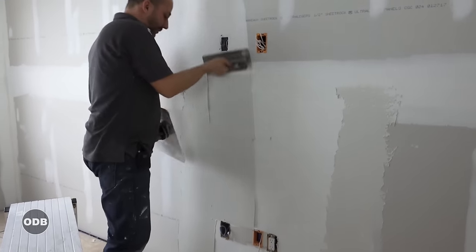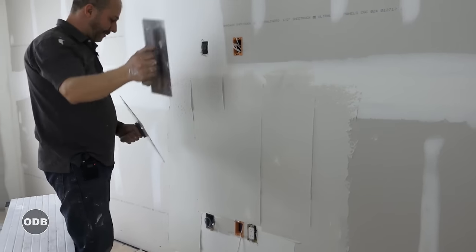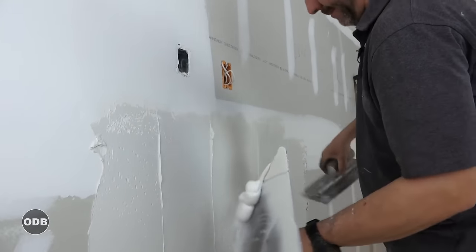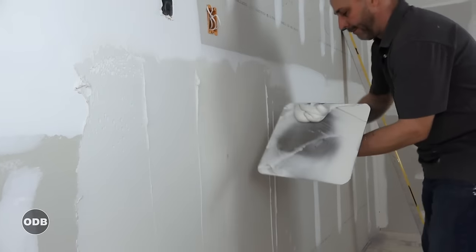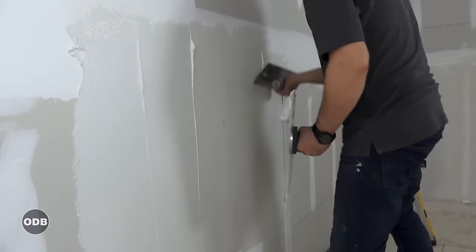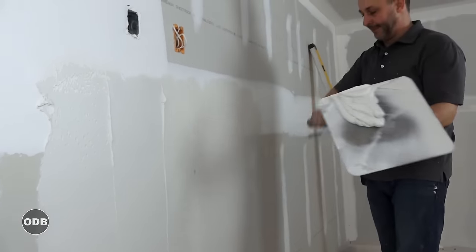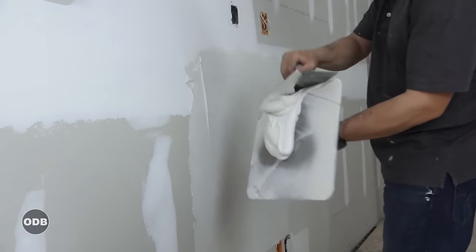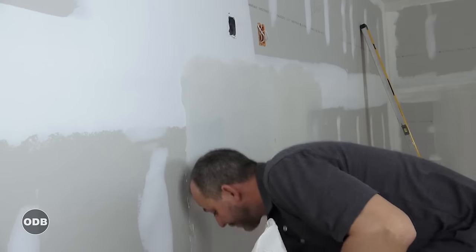We have plugs and everything in the middle that can be an irritation. All we're going to do is put mud everywhere because it's final coat. We're going to start where our tape joint is and using really good pressure, clean that mud off. Using a little bit of outward pressure but not much, pretty consistent, we clean that off because it's been filled up and raised. The secret here is to make sure that you have nice clean mud — no dirt in it — and you won't get any scratches, so you won't have to come back and fill anything up when you're done.